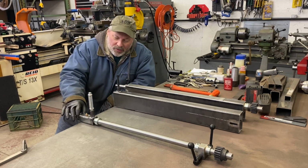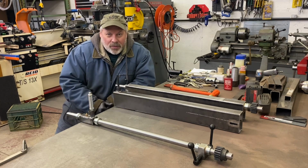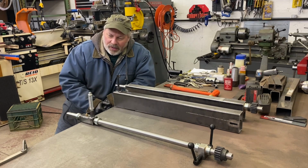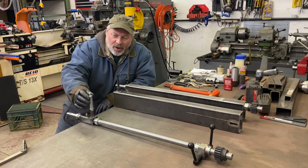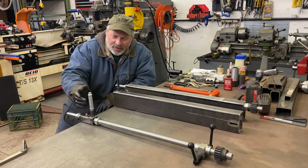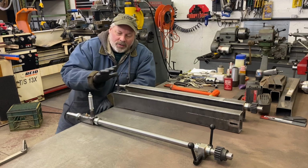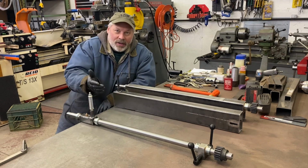I've already told you about how I made the round tube itself with a Turbo 400 sun tube or stator bushing. Same bushing goes in the transmission in a couple places. This is just a 3/8 bung, 3/8 ready rod, and I can adjust this. I actually got another spring that'll fit inside this if needed. And when I adjust this down, I'll cut off the stud wherever it falls, because I don't think it's going to interfere with the handle I have to build here, but obviously I don't want it running into it.